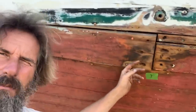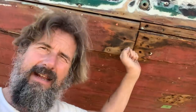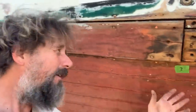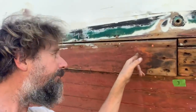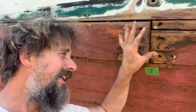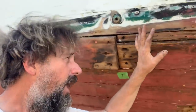The outer chine log comes along and basically begins at this butt block, so this plank actually has to take quite a bit of a curve to begin that whole process. This is the butt block that failed on me while I was afloat last year and scared the heck out of me. I've just removed everything inside, but that's good — I knew this butt block was going to be bad. Now I can really tackle it: put in a super block, put in lots of bolts, probably both sides of the frame, and a large piece across inside that will bridge it all together, because this needs to be absolutely rock solid.